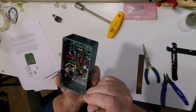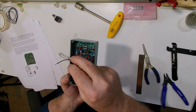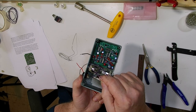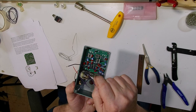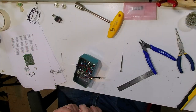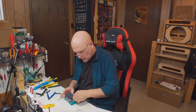A lot of the connections for the DC jack socket, the input/output jacks, and the foot switch are actually done on lugs of the various jacks and not directly to the board. So these six wires coming off the board are the only wires that connect into it — right now it's a bunch of mounting the parts and then we'll be soldering. The positive of the battery jack goes to this middle tab, and the wire labeled positive on the board will also go to this tab. There will be a wire going from this tab to the ground connection, and that is also where the negative connection of the battery connects.